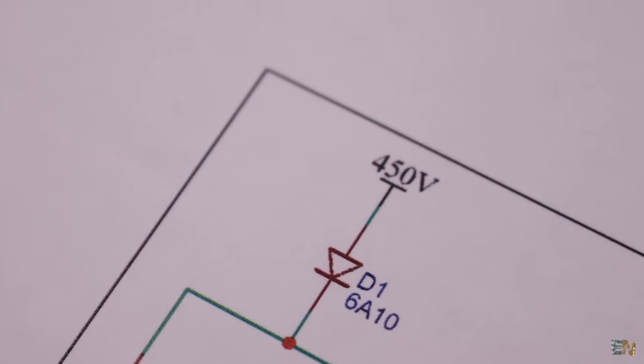As the gun barrel, I will use an 8mm metal tube. It would be better to use a plastic tube so there will be less magnetic attraction and also less friction with the bullet. You also have to make some holes on this tube from side to side. And the space between these holes is the same as the space on the segment PCB. Through these holes we add the infrared LED and the sensor, so like that we can detect when the bullet is passing through.